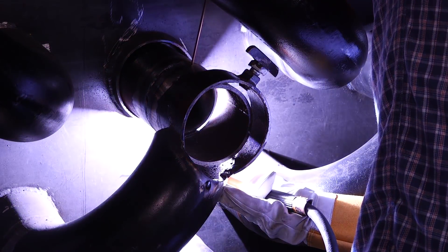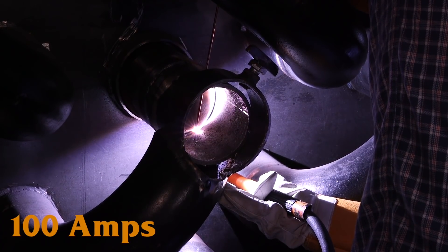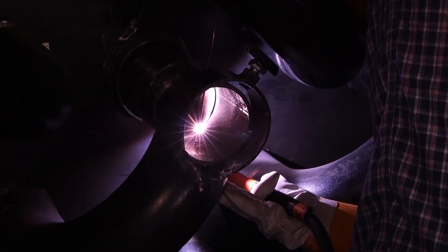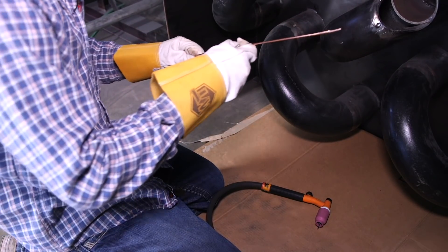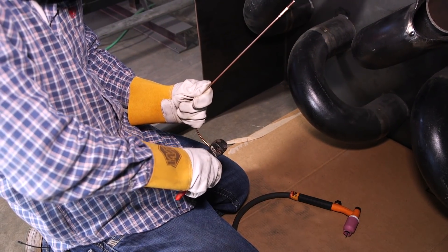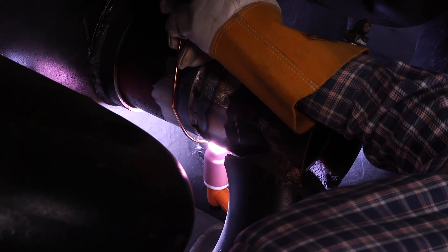On the right side, since I had a bigger gap — the other side was kind of tight — I'm running at 100 amps and I have a 70S2 1/8 rod. The right side is always going to be easier because that's the way I started, with my right hand, so I have more control. Also, you can't use a straight wire in here — you always got to bend it some way. That way you can get penetration on the pipe. If you don't, it'll bubble up, start dripping like water, and fall out. You always want to bend your wire — like a J shape. You can bend it however you want, so you can tackle those bevels good.